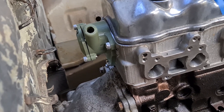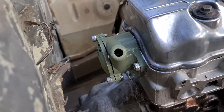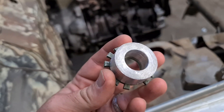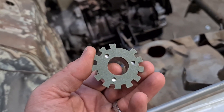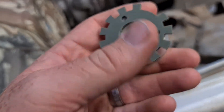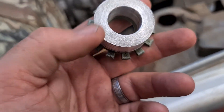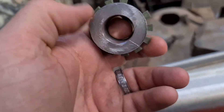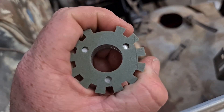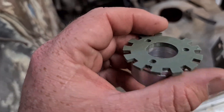I'm really happy - there's a few changes to the design I've got to flick through before we go for the final casting one. But as an actual part itself, that would actually function until it got too hot. Now the other thing I've done is create a fake one. As you can see it's actually quite tight - you can see a little ring in there. That clamps down, hold that in the vise, run a bit of tape over it. These are your markers to drill your 5mm holes to tap your M6 threads. Then we get a new bit of mild steel, cut a 22mm hole in it, run the three holes for the three bolting holes through that, bolt it together, use this as a template.